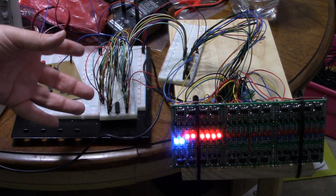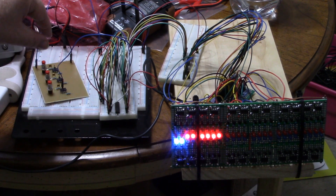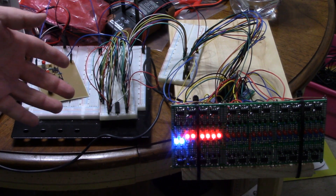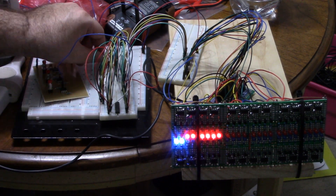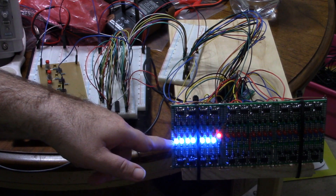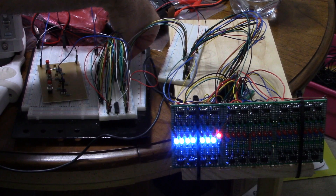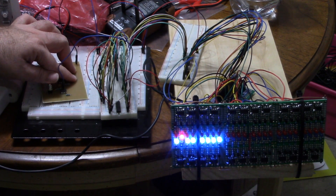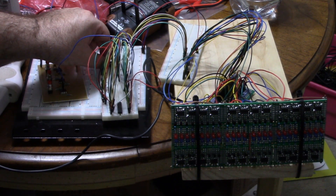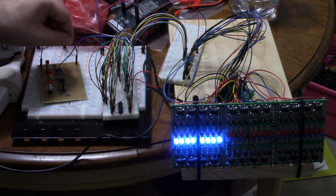There are many different shift registers on the market, so you'd want one that has a dedicated left pin and right pin so you can connect a single push button to each. I've cleared the output and shifted a single bit in — so the device is rebooted with my '1' loaded. Making it circular, if I shift one way the one just keeps going around and around, and if I change the shift direction the one goes the other way, circling forever.